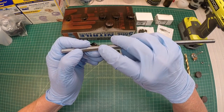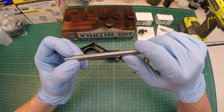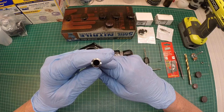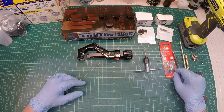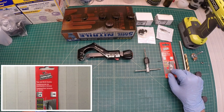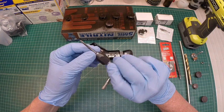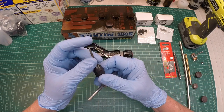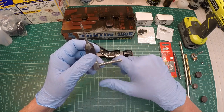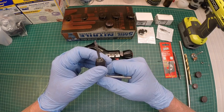Since I'll be drilling a hole and using a tap, it's definitely thick enough and rigid enough to hold a nice set screw very firmly. I probably could have used brass, which is definitely softer, and it would most likely still work. The other items I ended up ordering were a tap and drill combo — I really didn't need that, since I ended up finding my 6-32 tap in my toolbox buried at the bottom. But now I have two, plus the number 36 drill bit, which sizes everything correctly for the tap itself.